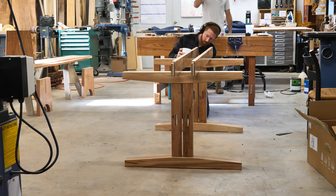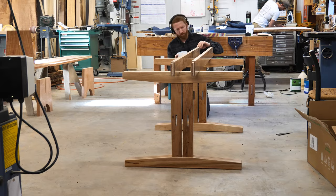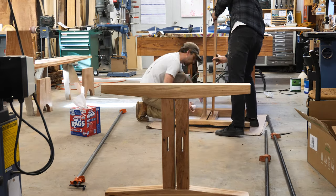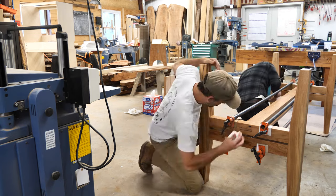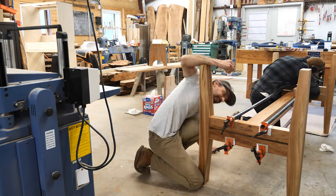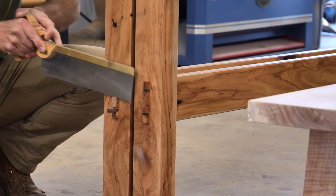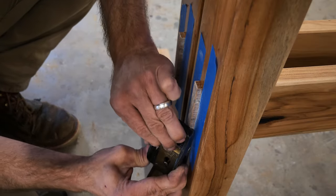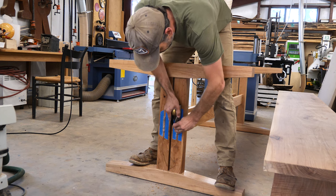The uprights are already assembled — these are actually my favorite part of this whole design. There are four parts with eight joints total, so it's a really strong structure. You've got double mortise and tenons on each one of those uprights, and those come together with the two stretchers with the three mortises. Once we get those stretchers in, we work with clamps and a tape measure to get them co-planar so they're not tweaked. Then I come back with some walnut wedges and hammer those in. Once the glue is dry, we pop the clamps off, saw the wedges off with a handsaw, take a block plane and do a little cleanup, then chamfer the edges. I tape it off with blue tape to prevent burnishing the wood and to protect the finished part.